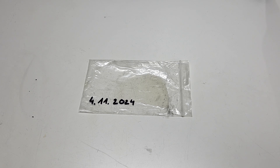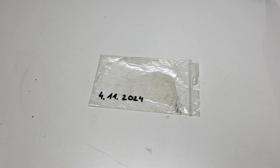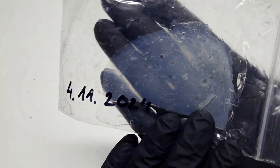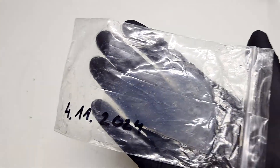Actually they are correct, because if I don't fill this kind of membrane with zinc salts and preservatives, then of course the agar-agar gel will not last for a really long time. But because this kind of membrane is meant for zinc-based batteries, these gel membranes are also filled with zinc salts. You can also add some preservatives if you want.